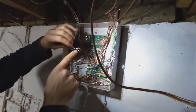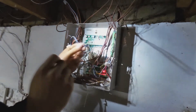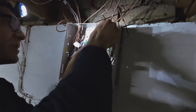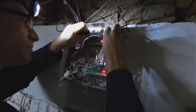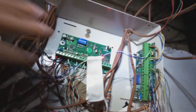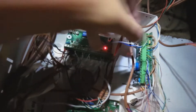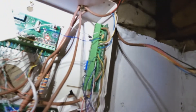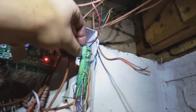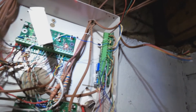So that's what it looks like — the smoke detector signal wires, blue and white, with a 3k3 resistor in parallel. I'm now going to put that across the zone, which happens to be zone 63. I've wired the smoke detector wires through to another box and labeled it 'smoke detector.' This is bus six — dip switches two and three are on, which is binary 110, which equals six, so this is expander 6. And there is the parallel connection.